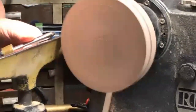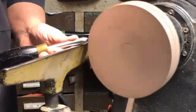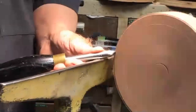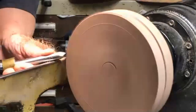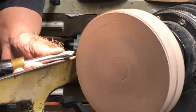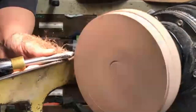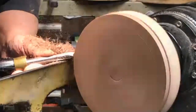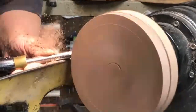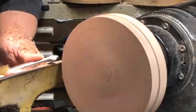To start this, I want to pierce the wood with the point, but I do not want to be in a hurry. I need to have a ledge to work on. Once I have that ledge, I can ride the bevel across the wood. You can hear there's some more there.